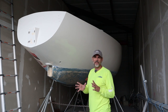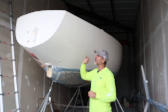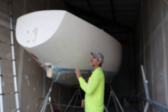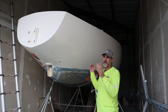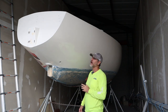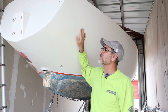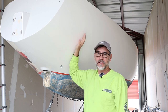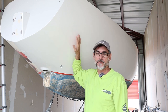I've got three coats on now. I went ahead and put another coat on — I was only going to put two but the wind picked up and I wanted a thicker layer. The wind and the heat caused it to flash off a little quicker than I wanted. It's the next day and it didn't flow out as well as I thought. I didn't thin it as much as I should have and could have gotten it to level out much better, but it doesn't really matter because I'm going to sand these first three coats anyway.